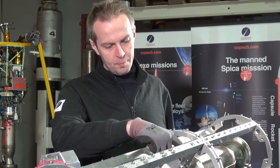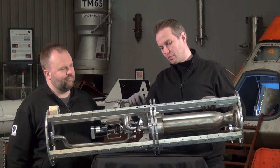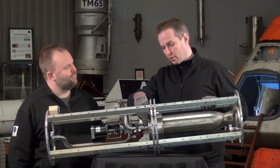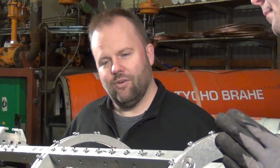It's bolted onto the LOX dome, which is then bolted onto the airframe itself. So the engine alignment is actually done by aligning the LOX dome, and we did that a couple of weeks ago. What would happen if we didn't align this properly? Well, that would give you a thrust vector that would be a couple of degrees wrong, and then the jet vanes would have to work excessively to correct for that alignment error. So we have aligned it to within one degree, we believe — so it's pointing along the length of the rocket.